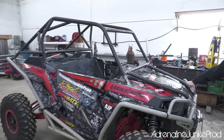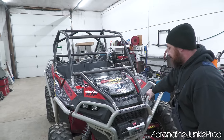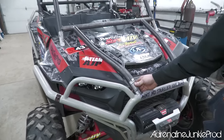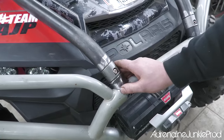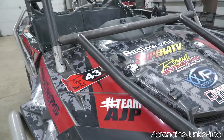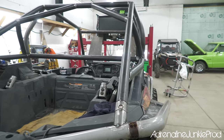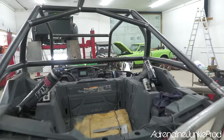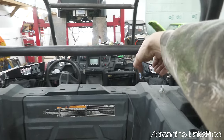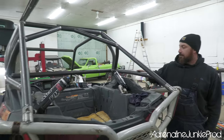Oh, yeah. So we got the overhood bars done, and I think that really, really tied this thing together. They're not even tacked yet, but we got them sitting in a good location where, if they're not tacked and they're holding together, yep, that should be where they go. Press fit. Even on the bumpers and in the front, it unbolts. So we've gone from 6 main cage mount locations to 10, right? Yep. The last thing we have left is Blair's gonna bend up some bars that go from here into the harness bar. Matching this profile here. Yep, matching that profile there.